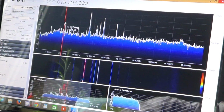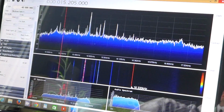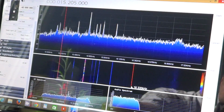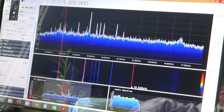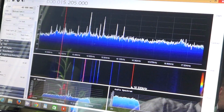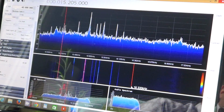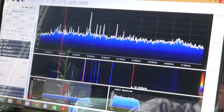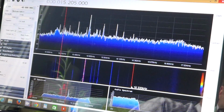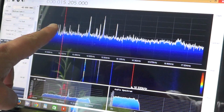What's also nice is that you get the peaks. You see the peaks moving with propagation, which is already nice. Something quite amazing also that I've seen is ionospheric sweepers. You know, sometimes you're listening to a frequency and you hear that little whoop go through. It's these ionospheric tests by the US Army and certain governments to check for optimum propagation. And what's amazing is you see them sweep across the display here.